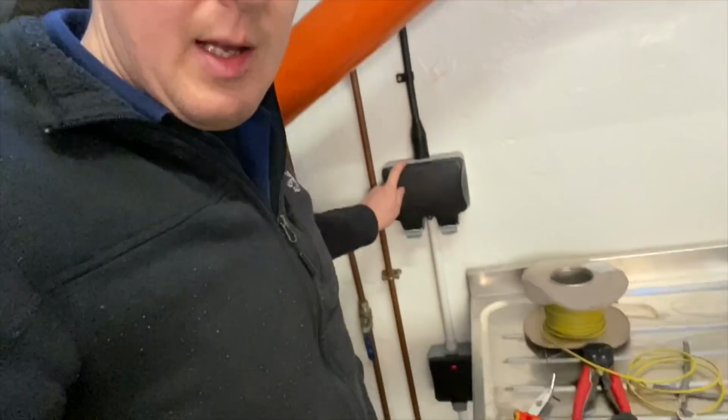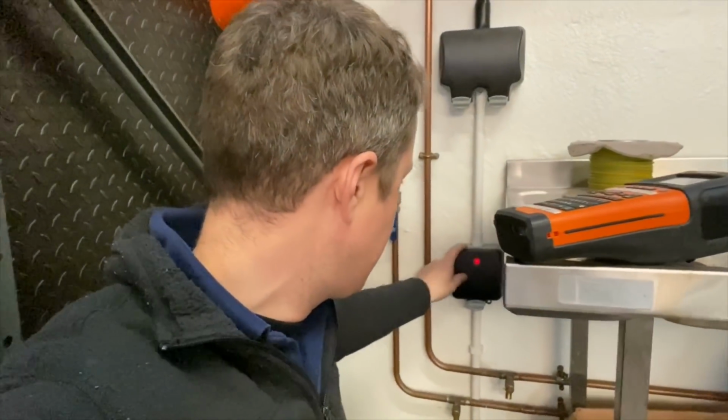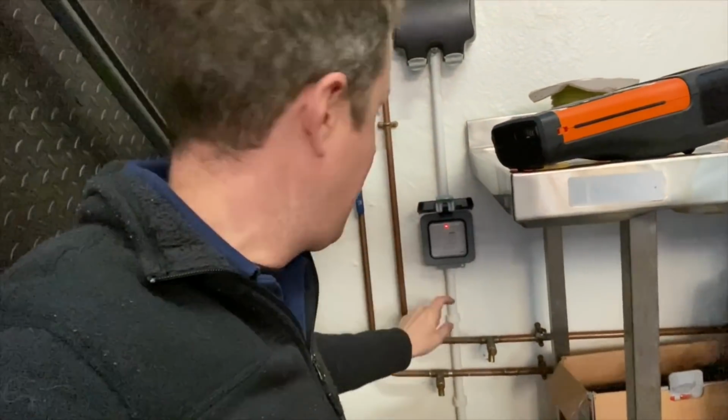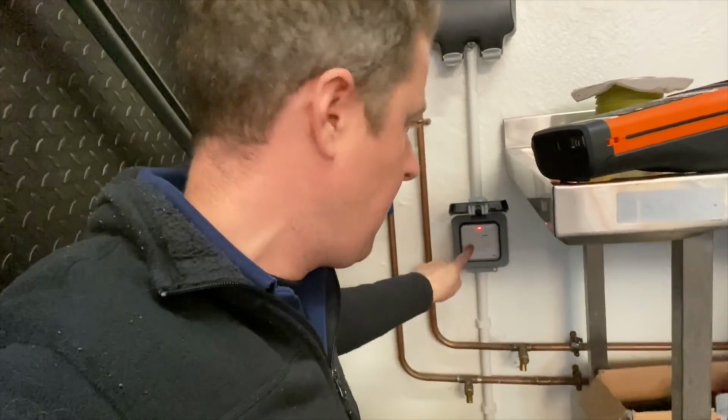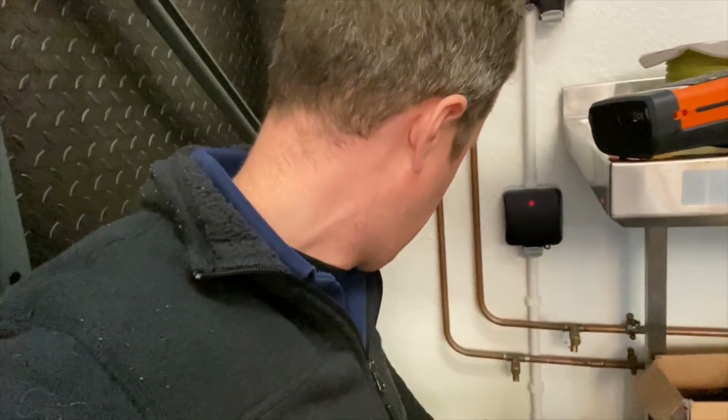So that is the light in there done. I've got my socket here now spurred off into this switch fuse connection unit. Switch fuse connection unit is labelled up, toilet light, 3 amp fuse in there. Then the conduit goes down and along and through the wall up to that switch that I've just shown you. So neat little job, fairly easy bit of conduit work.